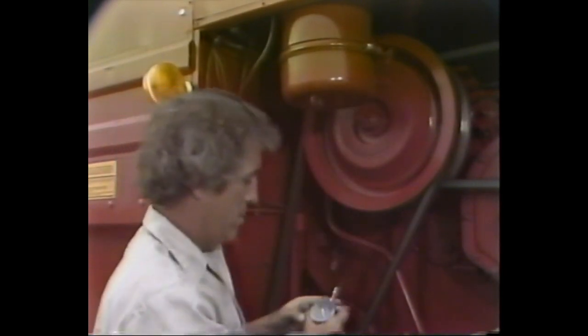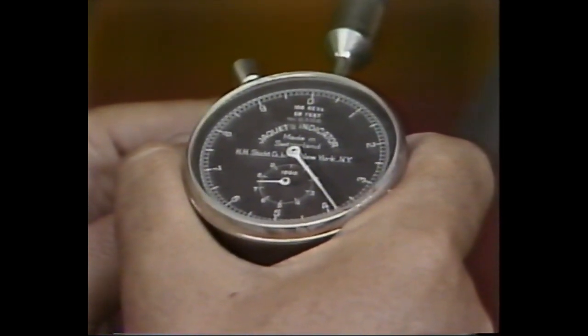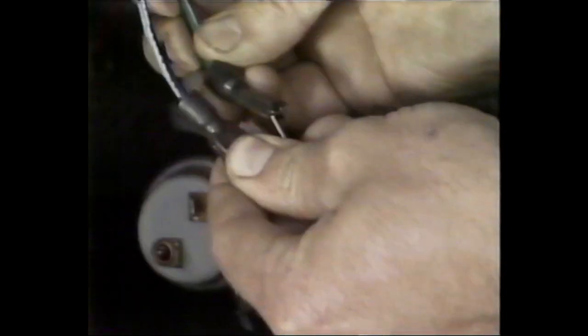At the end of this time, place a tachometer on the rear beater and check the speed. If the combine is an MF 750 or 760 equipped with a digital tachometer, use it to check the speed. The correct beater speeds will vary according to the model and serial number, so refer to your combine setup and pre-delivery manual for the correct settings.